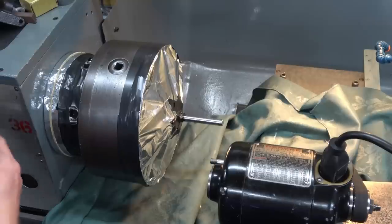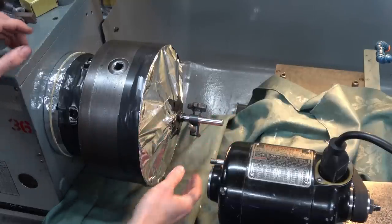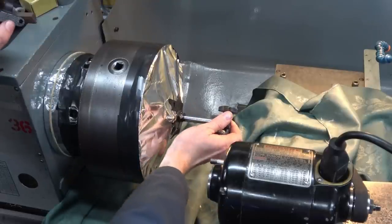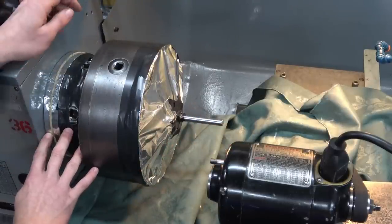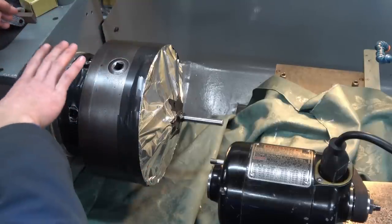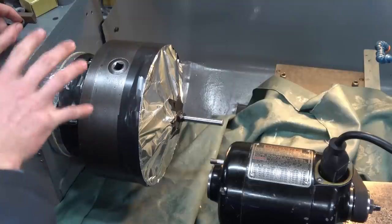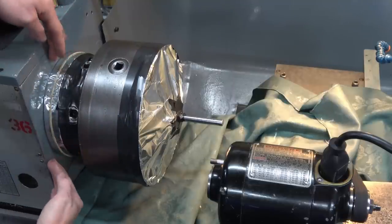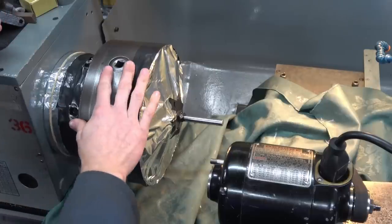The dressing arrangement for this wheel is going to be a single point diamond mounted on this post. For purposes of dressing I have protected the front of the chuck using tin foil. This portion of the machine is going to be subject to the most debris because the chucks will come and go, but this piece is going to be here for the entirety of the work. I suspect that within it the design is thorough enough that bits can't get in, but to make sure I've carried out this form of protection.